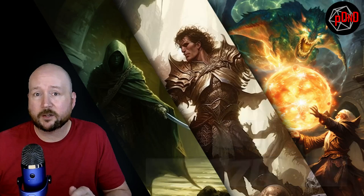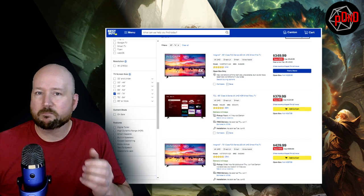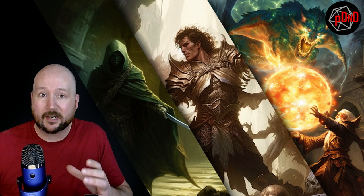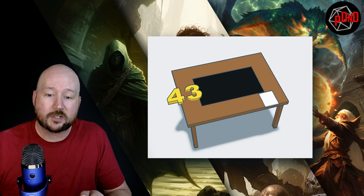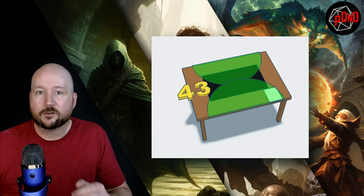The number one way you can mess up building a TV table is to go with too big a TV. It may be very tempting — since TVs have gotten really cheap — to go with a big 65-inch TV because you think it's going to look amazing. But the second you turn it horizontal and try to use it as a table, you'll see it's way too big. You won't be able to reach the center. As you can see in these graphics, a 43-inch TV has a footprint of 60 by 45 inches, and the green area I've outlined shows roughly my arm reach — I can reach the center without any problems.